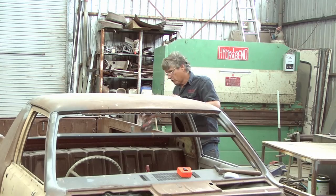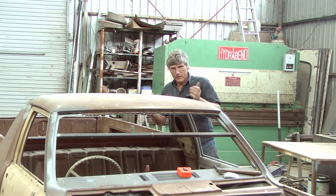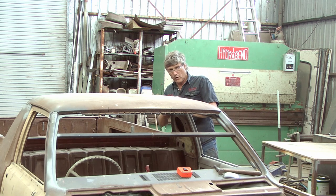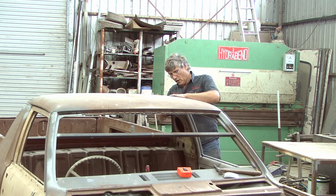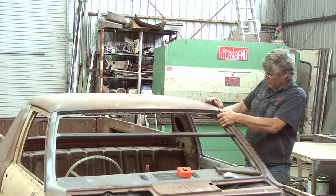So that's got our two screws in, and that's brought all this back piece of the roof, the back window opening, all back to where it should be. Just wants a vice grip putting onto it to help weld it together when we're going together, and I can push that down and the opening just lines up perfectly. This front corner here, same deal.